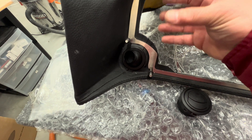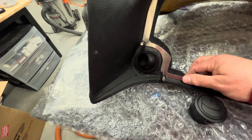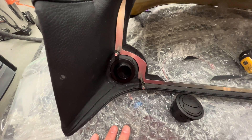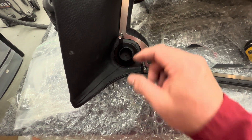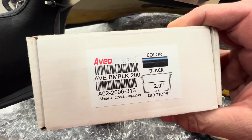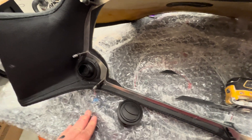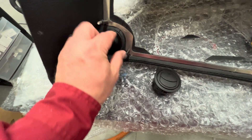I don't have the capability to design some fancy system — you've probably seen the build videos from Evan; he's got a fancy computer-controlled valve system that looks really neat. I've looked online and there are valves on the market for this, but I wasn't sure they'd work and they're kind of expensive, so we're just going to be at the mercy of the Aveo maxi vents. I'm using the Air Maxi with a two-inch backer. I'm going to use some 3D printed parts and a piece of scat tube to connect it up, and I have two-inch scat tube so I got the two-inch version.